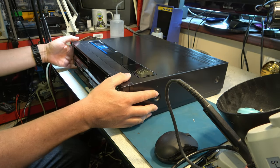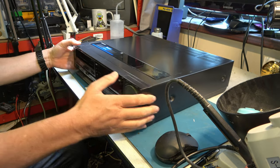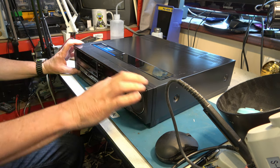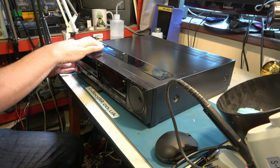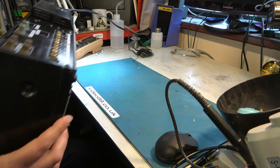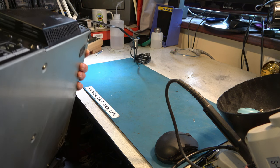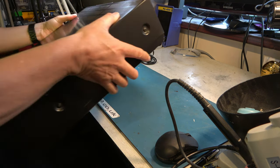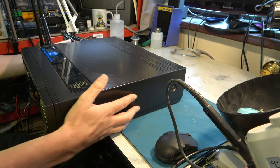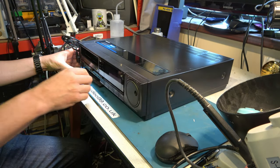So what's the supply voltage going to be? Oh, this all appears a little bit bent here. This is nice and smooth there, and it's raised here. So there's some issues around an impact, maybe. I'm not sure. Yes, let's check the supply voltage on this one. 100 volts. So I'll reconfigure my isolation transformer for 100 volts rather than 110, 120.